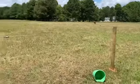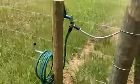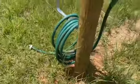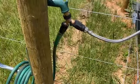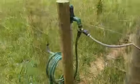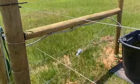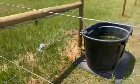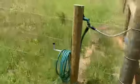So y'all remember paddock 1. The only thing that's different is I planted a water line right here, put a farm faucet over here, put a splitter on it, and wash my hands over here, or water this paddock if I wanted to. And I've got 2 Rainbird 25 psi reducers on there, so it reduces the city water down to 25 psi. Then I hooked a washing machine hose up, and they're used to being under large amounts of psi for a long time, so I just screwed it to the crossbar, ran it over to the water trough, and got the water trough sitting on a rubber mat. So it worked out real good.